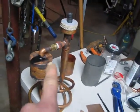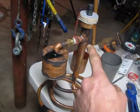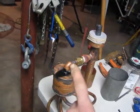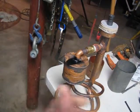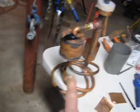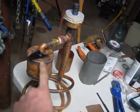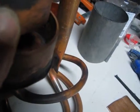And my next model, I'm working on some parts. I have to buy a T, and I'm going to solder instead of braze, so that if I want to reconfigure, I can do it easily. I can just sweat the fittings apart. So I won't be brazing on the next one so much, but I will probably be scrapping this model to use my diaphragm chambers. Also, another problem, which is probably the main problem with this device, is this sharp edge.